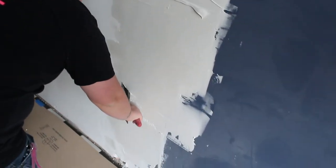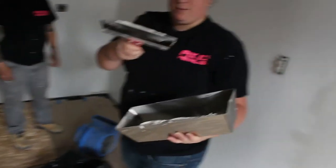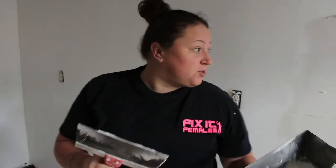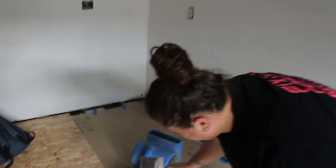I just went over Donna's work underneath. Whenever you pull from an area with already previously dry mud, you don't want to put it back into your tin — because if you mix dry mud with wet mud, it'll start to create little indents and divots, and then you can't get a proper clean mud. So just take that and throw it out.